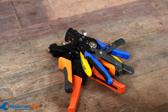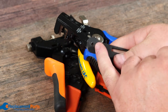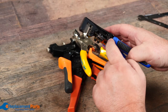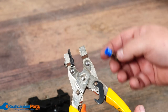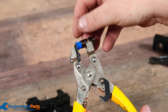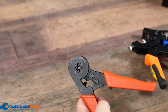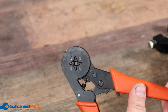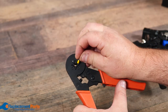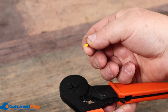Then we get into crimpers and cutters. We have a very simplified wire stripper where you squeeze to the diameter of the copper that you need and strip off the coating. More of an automated one: you put the wire gauge in, it squeezes and separates at the same time. Then you get into some of your more specialty crimpers, such as for television connectors where you just drop the connector in, put your cable in, and it'll squeeze and lock it. You also have a simplified ferrule crimper where as you squeeze it you'll see the diameter of the hole close — used in electronics to put a finished end on a wire; you just put the wire in, squeeze, and it locks the wire perfectly inside.